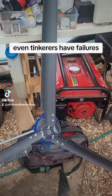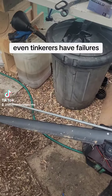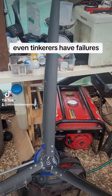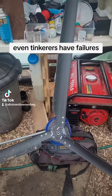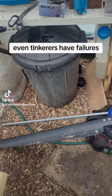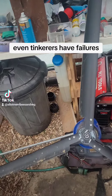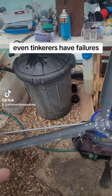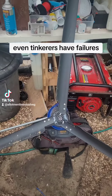We're nearly there — blades are fixed, one meter long, does make it a big old unit. It's raining cats and dogs so I'm going to give it five minutes to see if it eases up before I go out there and get soaked. All I need to do at the moment is jubilee clip this onto the scaffold pole, then go and put the top back on — I took that off so it's easier to work on — then put the pole up. It's not wired up yet, probably be another week before it's wired up, but at least we can see how it spins and leave it up there for a week to see if there's any problems before I start wiring it all together.